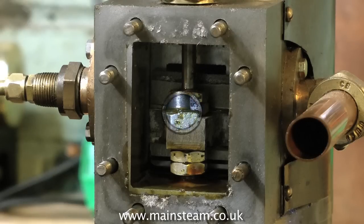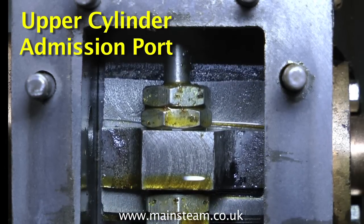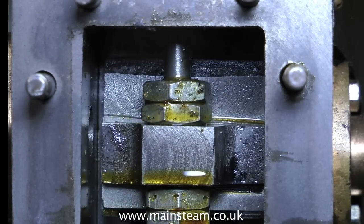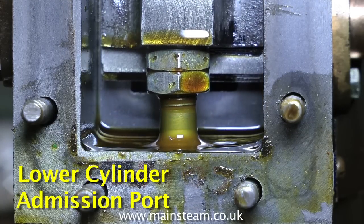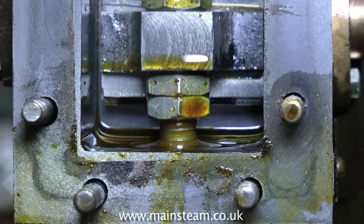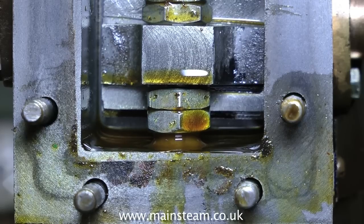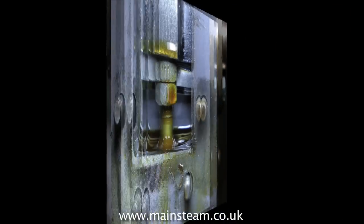On a Stuart 5A the valve arrangement is slightly different to the little ones. On the smaller Stuart models the valve spindle is threaded in the centre, but it doesn't have the double lock nuts. On the smaller engines there's a threaded crossbar which sits in a slot in the valve, and all you have to do is rotate the valve spindle to make the position adjustment. I've been moving the valve up and down on the video, which clearly shows the inlet ports at the top and the bottom. You can see that the valve is free to move a little bit, because if it's tight it won't seat on the valve face. It's the pressure of steam in the steam chest that holds the slide valve onto the valve face.